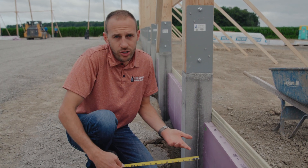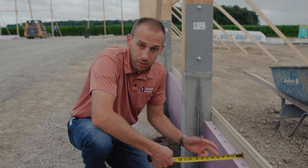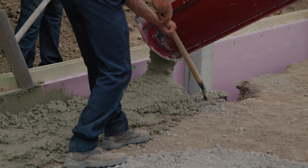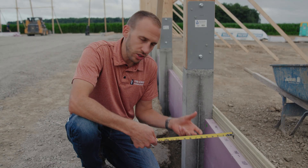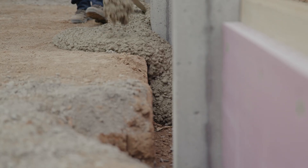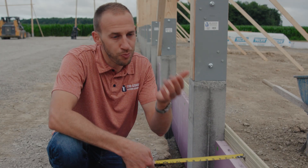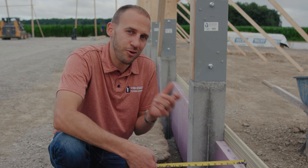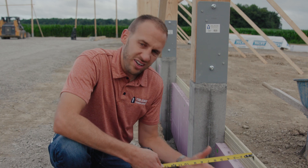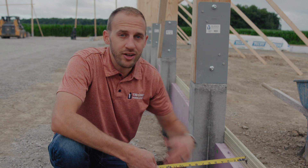It's going to be a 10-inch trench. Two of those inches are going to be eaten up by your styrofoam. The other 8 inches, what we recommend, is that you fill with concrete. That does two things: it gives you a backing against your styrofoam, but it also gives you a nice concrete grade beam around the entire outside of your slab. In post frame, most slabs are floating. This doesn't give you a footer because you don't need a footer — your permacolumn, your permanent foundation, is your foundation for the building. But this gives you the necessary thickness to the edge of your slab to help prevent it from floating, in addition to the frost protection your code may require.